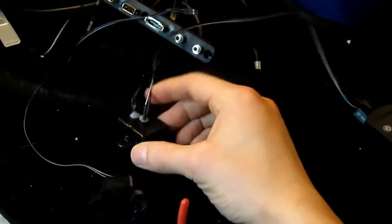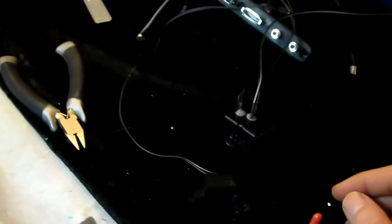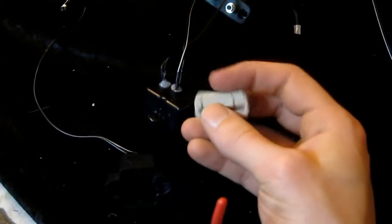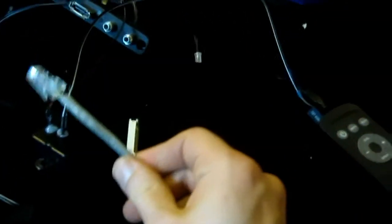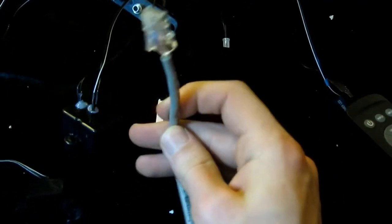So I'm gonna start taking apart the switches and the LEDs, remove the old wires, put on some new ones. The IDC connector here takes 26 and 28 AWG wire gauge or whatever. So the easiest way to get hold of 8 strands, 8 cords of that is good old network cable. This is 24 AWG, and that should be okay.